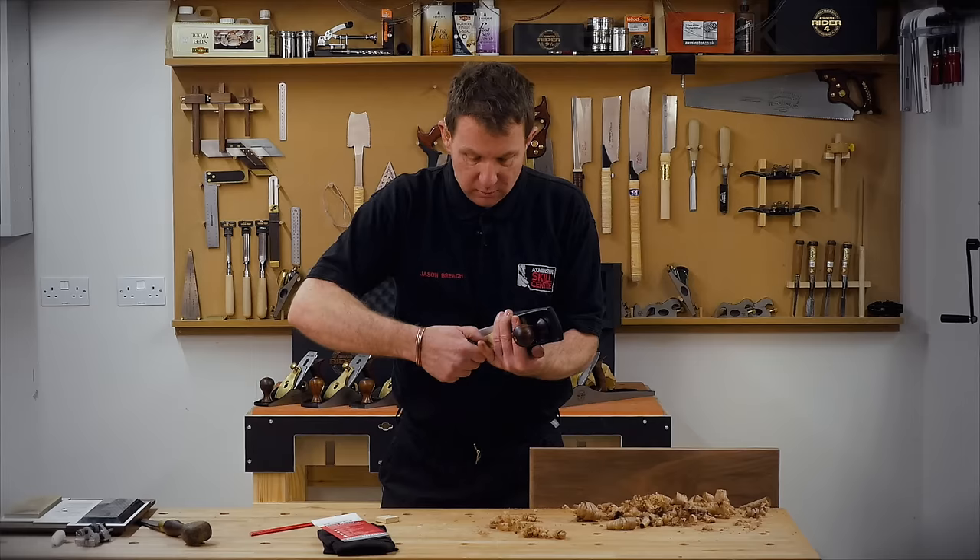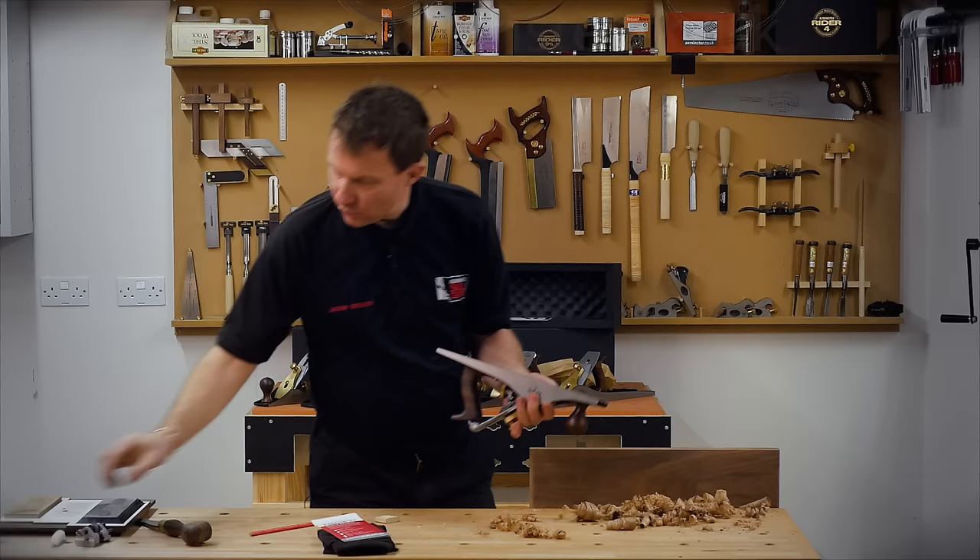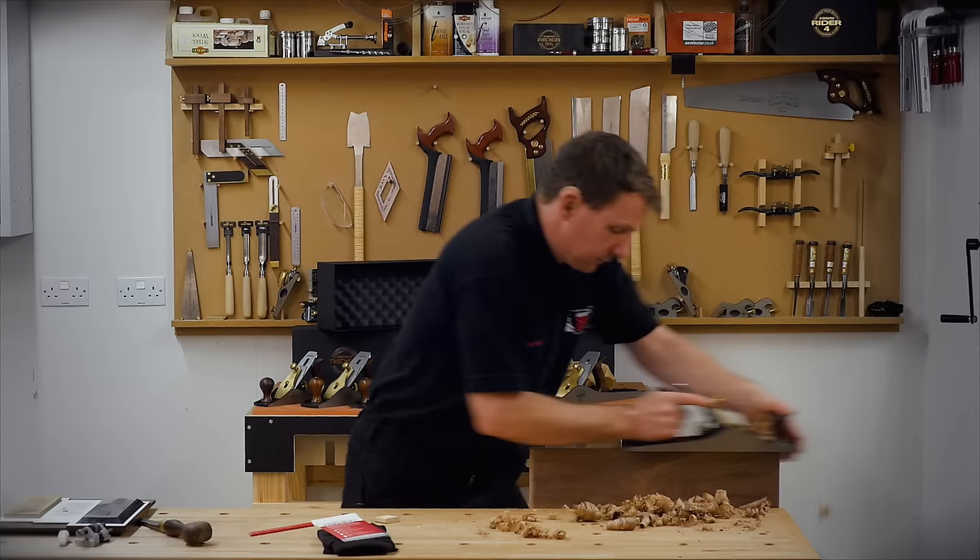So a little bit of wood — let's see what happens. That's a good start. Gently winding the blade forward, trying to find our cut. As we said, this is straight out of the box. Getting a little bit of drag, so to reduce the friction we apply a little bit of candle wax on the sole.